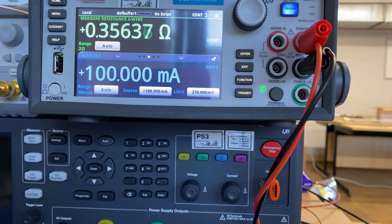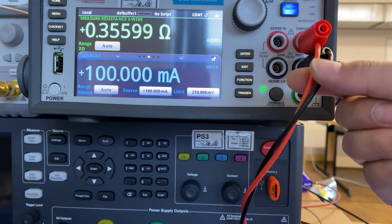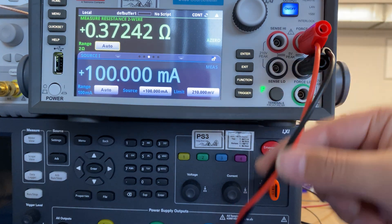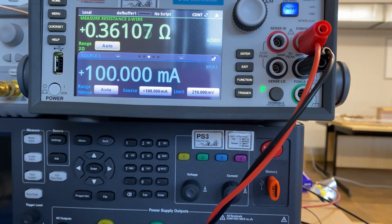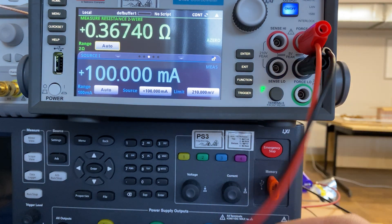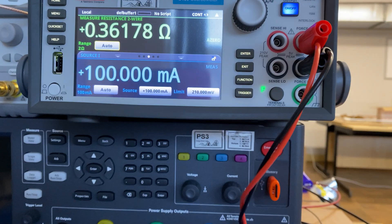It's quite large for a piece of wire. The reason is the instrument will consider the wire coming out from the instrument leads — the resistance of those leads is also included as the resistance of this wire, which is inaccurate.